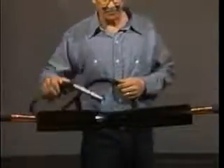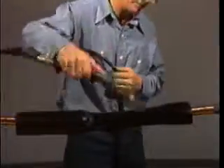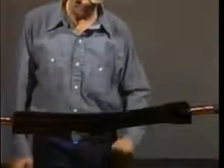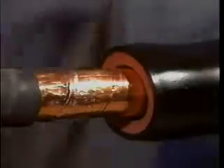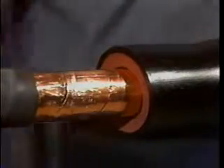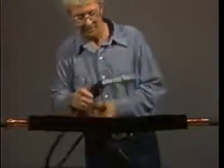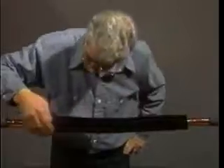You may now start to work the torch to one end of the tube. Continue to move the torch in a brush-like fashion around the entire circumference of the tube. Stop shrinking when you are 4 inches from the end of the tube. Now return to the center and shrink the other end of the tube, again stopping 4 inches from the end. Return to the first end and shrink the final 4 inches. Then go back to the unfinished end and complete the shrinking of the tube. In some instances, the dual wall tube may not shrink down to the cable semi-con even when correctly installed. Finally, post-heat the entire tube for an additional minute. Inspect the tube both visually and by touch to ensure that the ridges have disappeared. If they are still present, continue heating the tube until it is smooth.